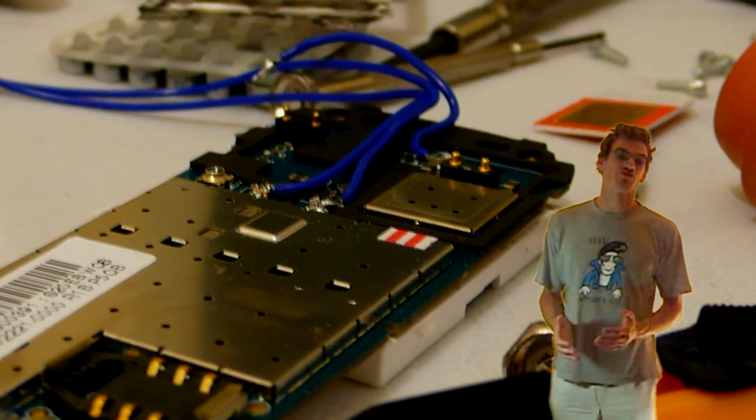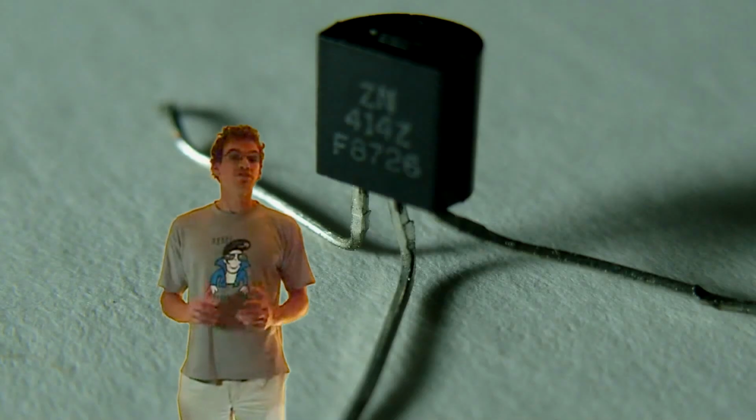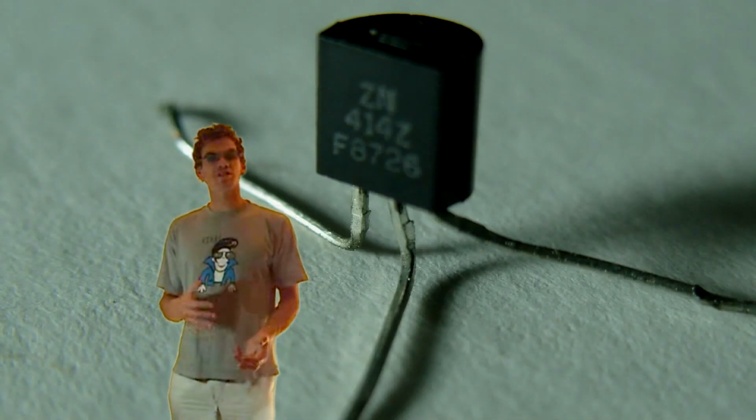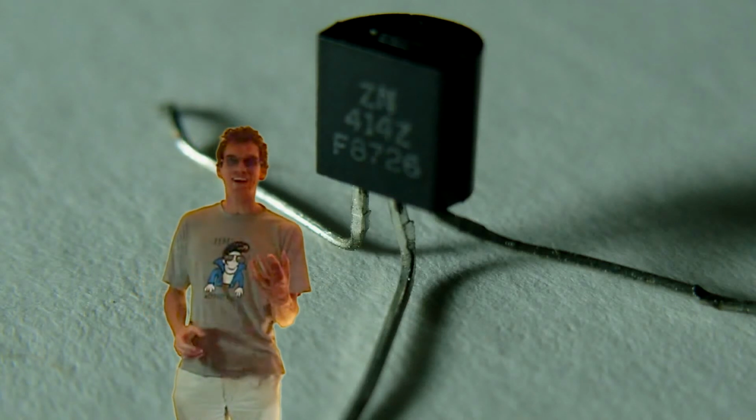Don't try to connect the motor directly to the board. It'll only end in tears and won't even make the motor twitch. The transistor is the most important part of the puzzle because it separates the fragile circuit board from the ruthless motor that's just urging to go.